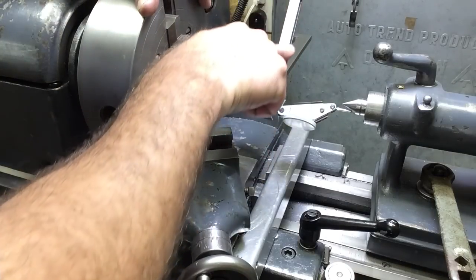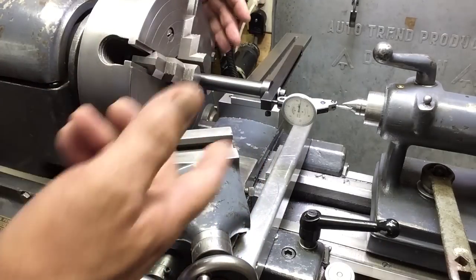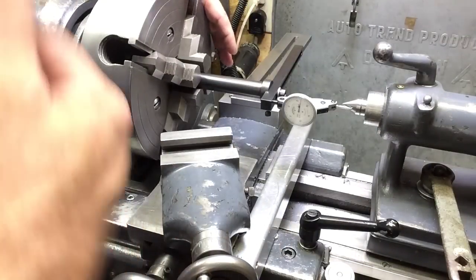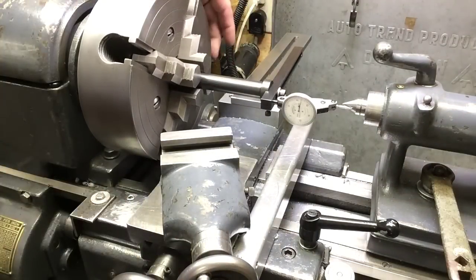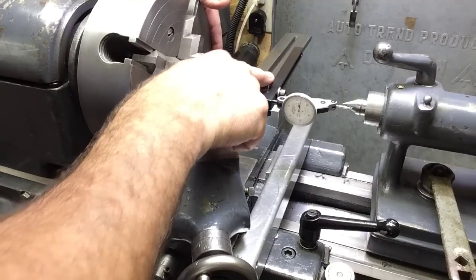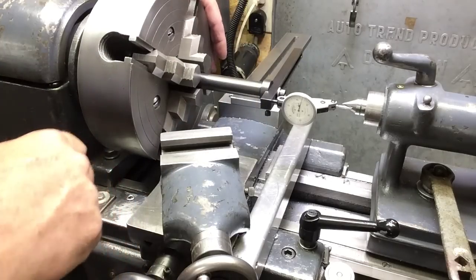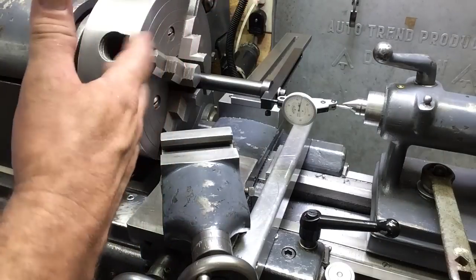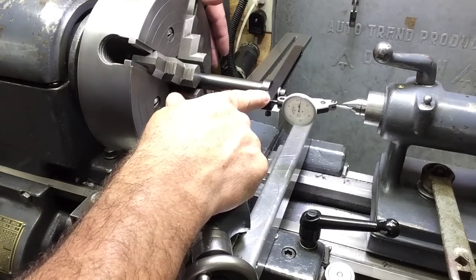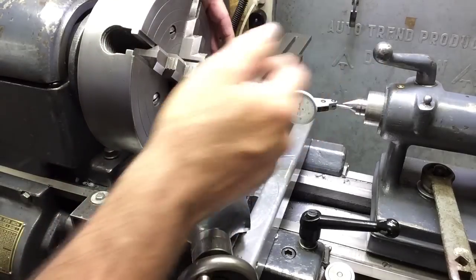This crossbar here is adjustable, so you can do larger circles — I'll show a setup on the mill where I used it to set up a larger round piece. I put this in the four-jaw and actually dial-indicated the end, so I'm within a half-thousandth on the end here. I didn't really have to do that, but I did. I get the same reading whether it's five thousandths out or not.